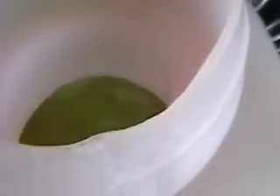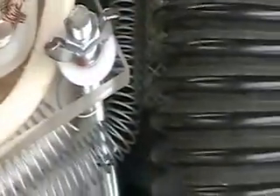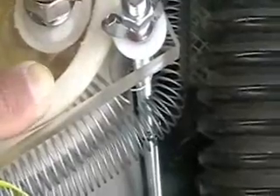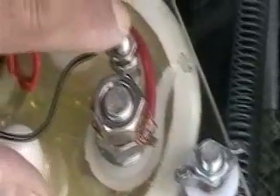Here's a good look at the hydrogen bubbles coming up from the bubbler — you can see there are a lot of them coming in there. This kind of bugs me though — these things get loose too easy. That means this ring I'm using as a seal is wrong; I'm going to have to come up with another type of seal because it just flattens out. What you're looking at here is the water sensor.